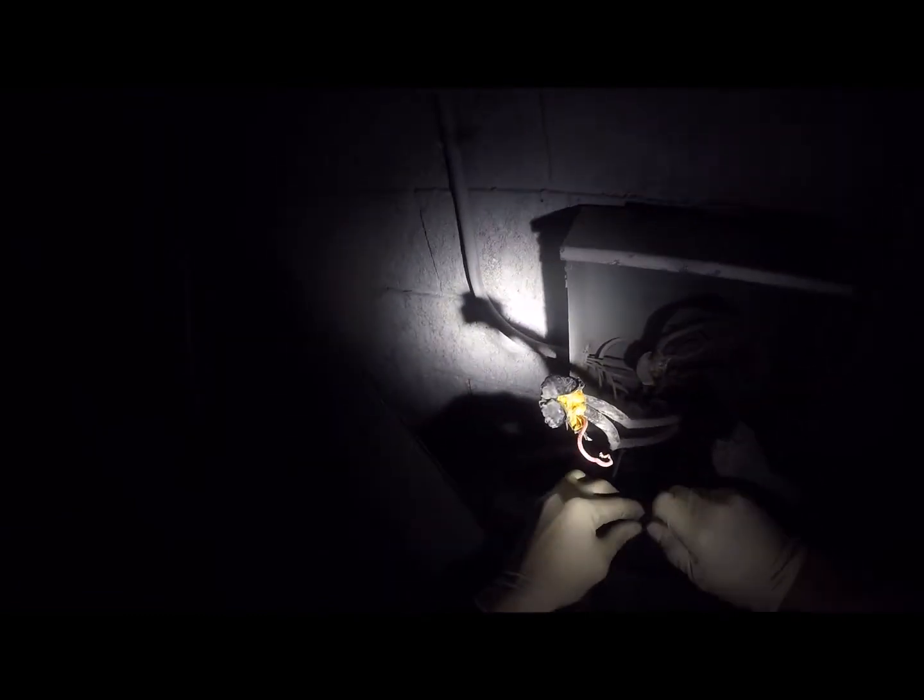Let's throw this one onto here. There you go. No, that'll fix our light problem, but that won't fix our electrical issue. We have a third phase out on that panel. That's why we're having arcing issues, and that's our third phase right there. That's why we're right here trying to fix this right now. So what needs to happen is I need to... Why don't you just take that up and turn the breaker on as is? Why would I want to do that? We're trying to fix a problem, not leave it alone. Cheapest fix: just put two wires together and let it go. No, then they arc and you got problems.